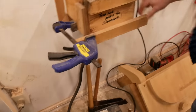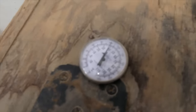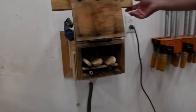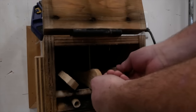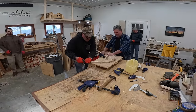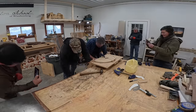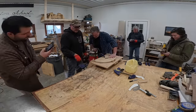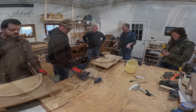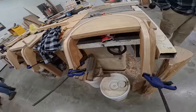The steam box goes through the wall, of course — it's about six feet long. I thought that was a cool idea. It's funny to go to somebody else's shop and learn all the cool tips and tricks that you'll go home and steal from them. In this case, this is a permanent steam box. Obviously Greg makes bent back chairs for a living, so he needs a permanent steam box. Now we take it out and prep it — it's really important to get that center line right on the crest of the bend. You bend it and you put those pegs and clamp it in place. You have about a minute to get that bend in place before it starts stiffening up again.